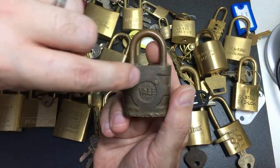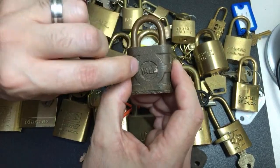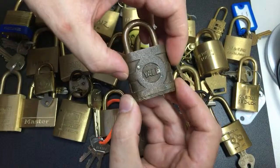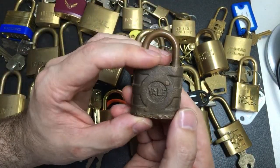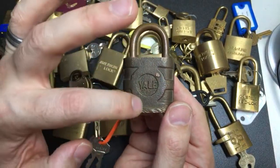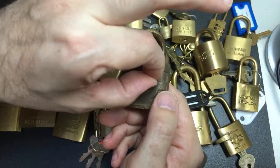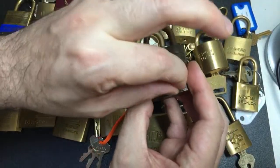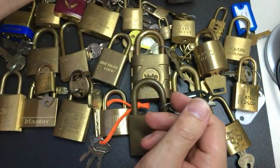what I might do is I might just mill out these pins here, and I think this side as well, and then this sort of does slide off. I can't remember who sent me one of these, or lent me, should I say, where this had actually been very tastefully drilled or milled out, and then put these little brass grub screws on, which is kind of nice. That just made a really nice lock.